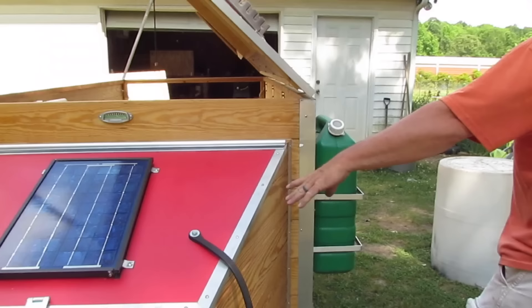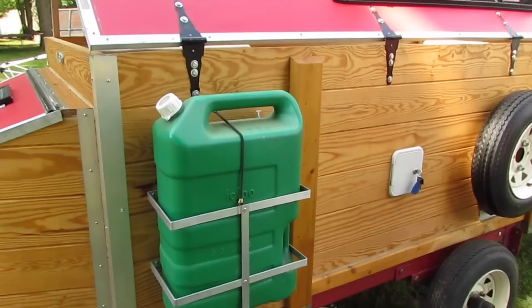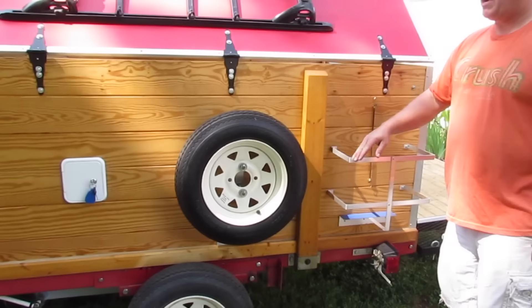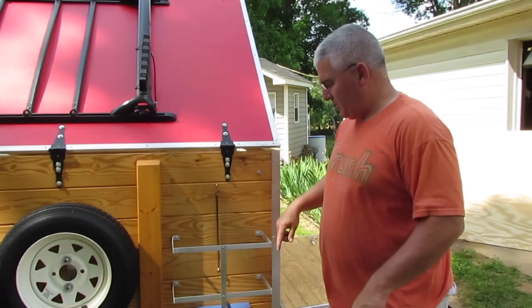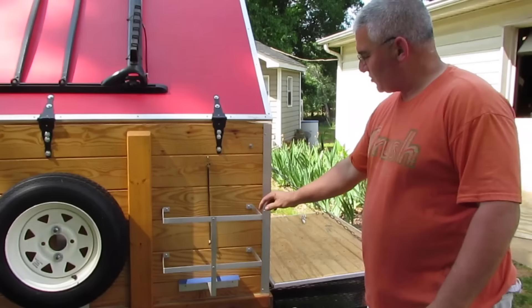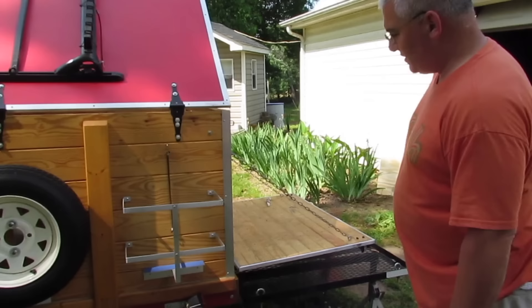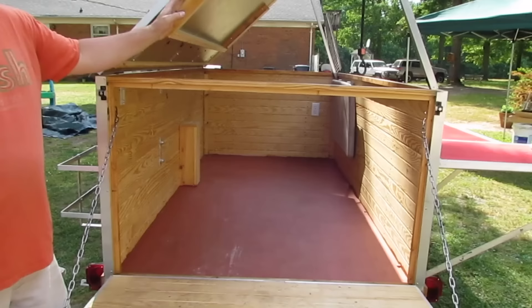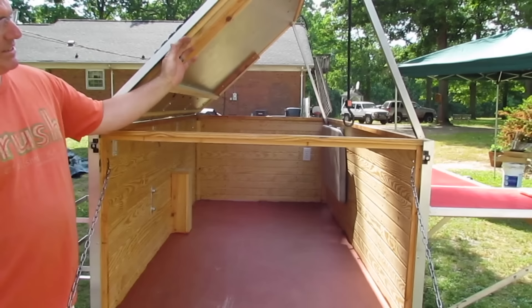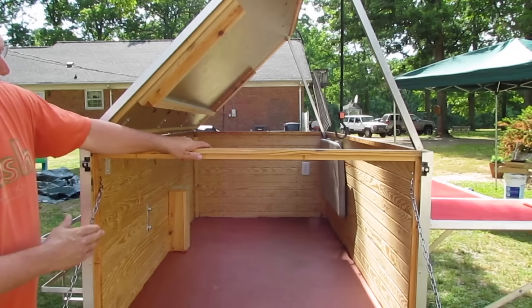Electrical box, water containers on the sides — I think this was like seven inches by fourteen or something. Pretty easy to make — just use a vise, get your measurements, and bend it. Once you bend it down you need to use a hammer to really get it on the edge so you make a sharp corner as opposed to a rounded corner. I put this piece right here so that it can have something to lay against to kind of seal this part.